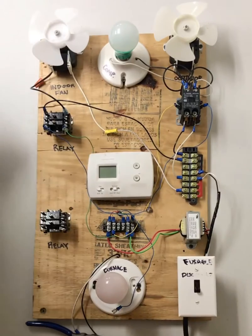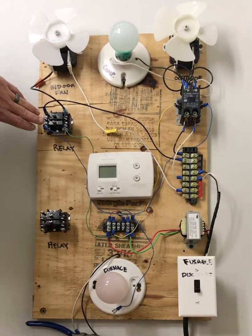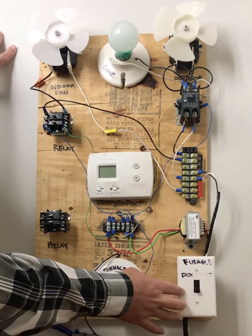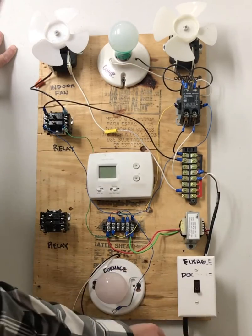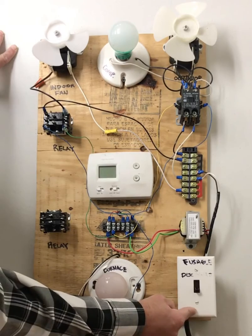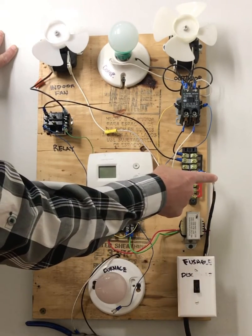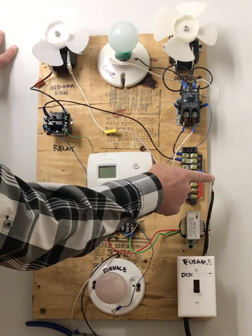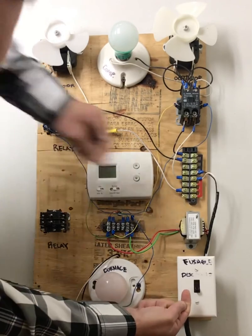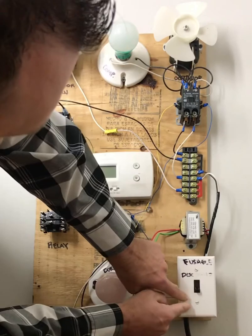Now, with a relay, the biggest thing you've got to remember is a relay is very much wired up like this light switch here. Internally, we have your neutral wire, your white wire, coming from your power cord here, and it's wire nutted directly with this white neutral wire here. It's not going through the switch. So your white wire comes in off the cord, this white wire comes in off that bus bar, and they wire nut together inside this box.